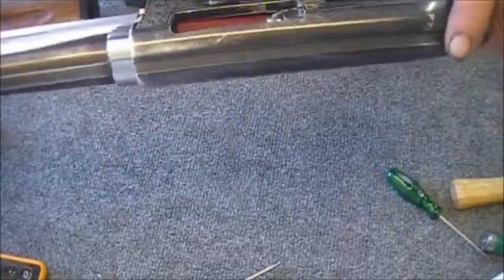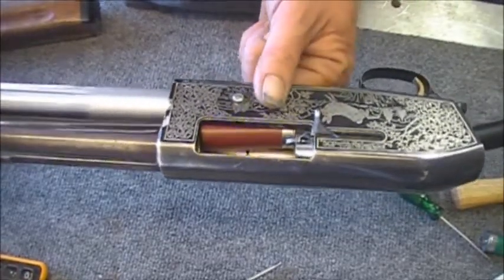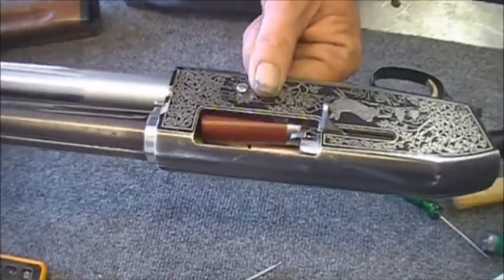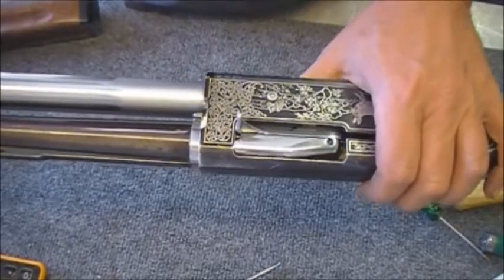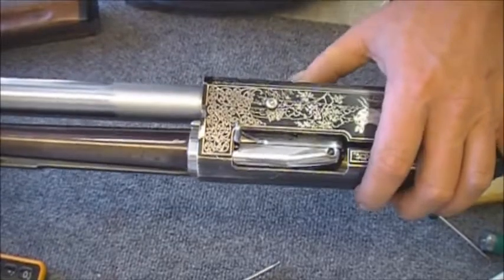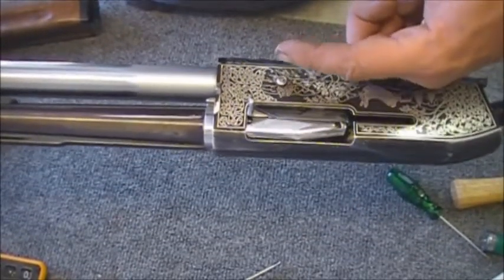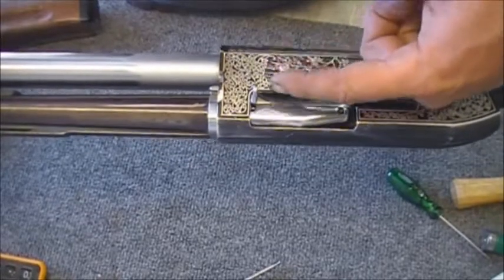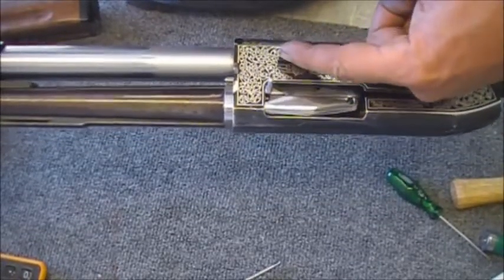This is another thing you want to look for: does this get bound on the shell carrier on its way up? Another common thing — if you don't have the spring tension on this, where I pointed out before for the kick up and the kick down, it's got to have enough spring pressure when it rides over center to lift that heavy shell up.